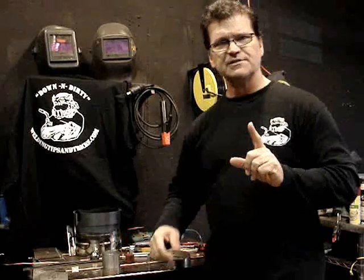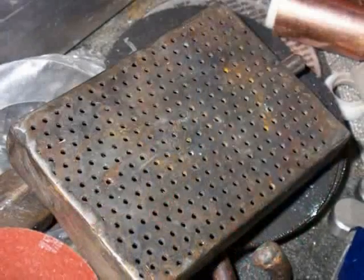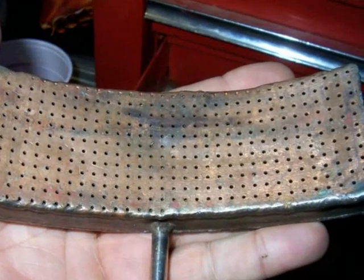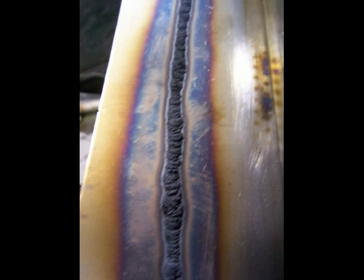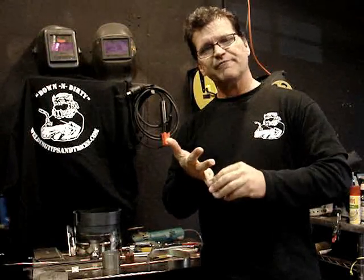What are some things we can do on stainless steels? Number one, we need to purge it. We need to purge the backside if we're going to penetrate through. Sugaring — no good. In order to purge the backside, you're going to need an extra flow meter for an extra argon line. You can fabricate your own backup boxes out of perforated copper or copper tubing with holes drilled in it. You've got to purge that backside if you want to maintain the corrosion resistance. There's soluble purge paper for piping, special purge tapes, and even special fittings and purge dams for small bore piping. If you use stainless steel, you need the corrosion properties of stainless steel — otherwise you wouldn't have spent the money for it.